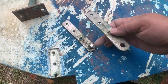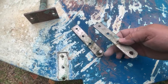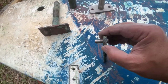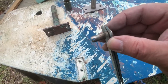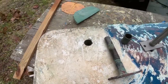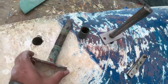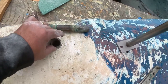You have the pin, the metal plate goes through the pin, and then you have the Dyneema or wire that you're going to use to control the center board. The other plate goes on the other side — it's all attached as a sandwich — and then you put a pin through to keep everything together. The center board gets attached through the pivot pin, which is this big brass pin right here. There is a brass sleeve that goes in this hole.